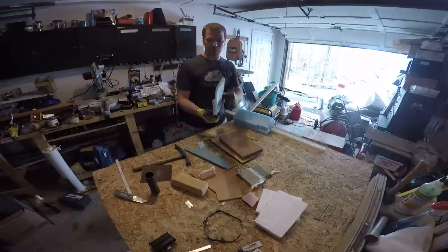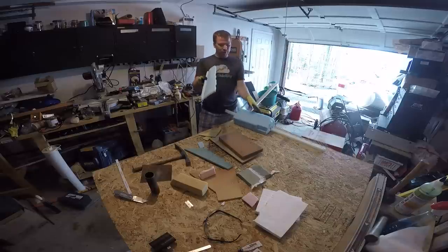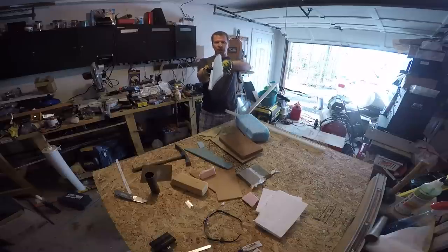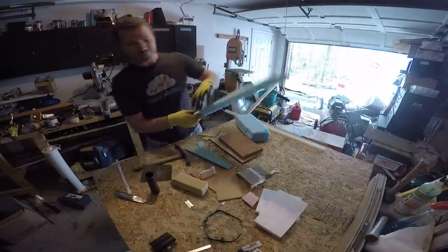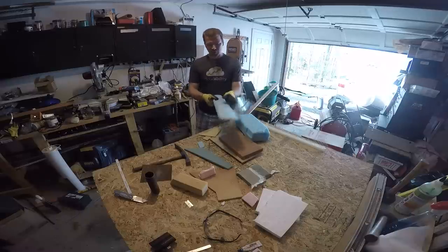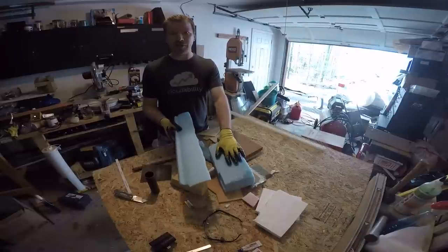So if you have a template of a curve — say cut out from a PDF or taken off the corner of a bus — you can totally hotwire this stuff. When you hotwire it you can get very very thin profiles out of it. This here was part of the leading edge of the wing of the airplane — this is the scrap material removed from the foam block after hotwiring the inner profile. When making the wing we took templates on either end — you can even see the nail hole where the template was attached.